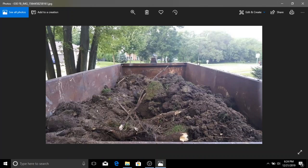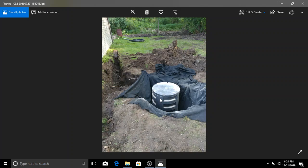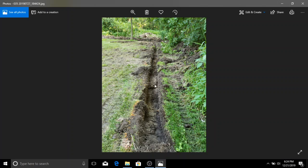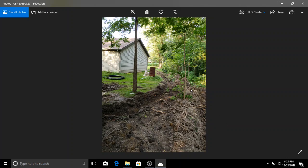Just more setting the sump pit. Here's a picture of my waste dirt — I could fill the 20-yard bin to only about 15 yards; they only let me fill it to three-quarter full. Here's the outer French drain — it only took 12 inches to get to the clay on the west side of the yard. The back of the garage is starting to get cleaned up — you can see a lot of the roots have been cut. Here's my berm. I also dug a rock stream back here. Here's that rock stream — I dug it a little too deep so I had to fine-tune it into a nice, pretty rock stream.